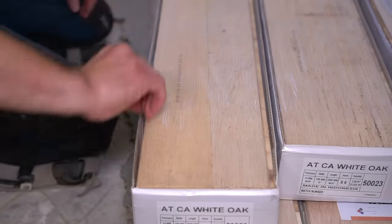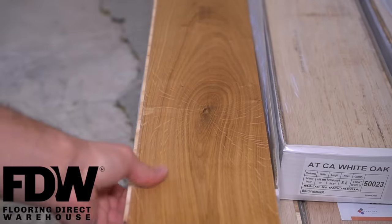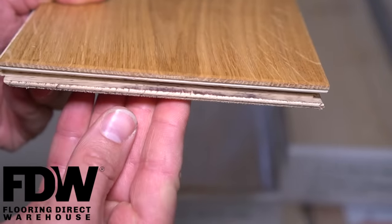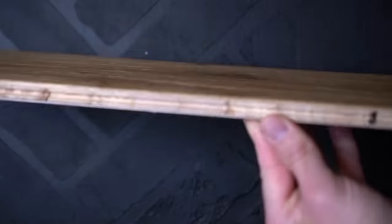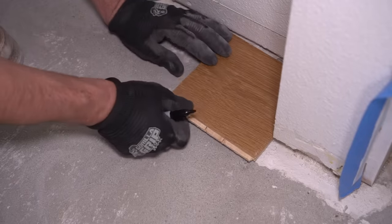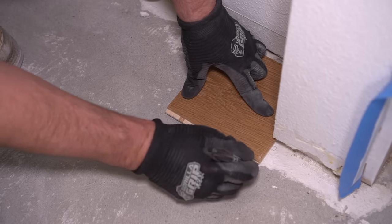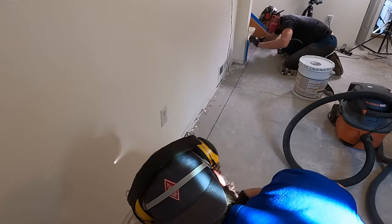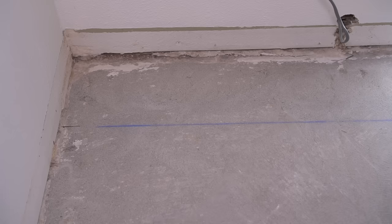This is six inch wide white oak flooring from Flooring Direct Warehouse. They provided all the material for this project and are the sponsor of this week's video. It's a beautiful product that I loved installing in my last video as a nail down version, but this is a full tutorial on how to apply it via glue down. The starting point for a glue down method is extremely important because all of our alignment works off this point, which is why I'm making a mark on the floor where I want the first row to start and then using a chalk line to ensure a completely straight line from one side of the room to the other.